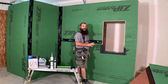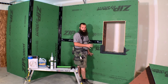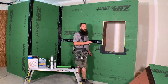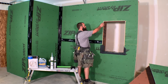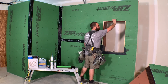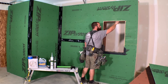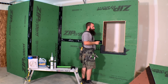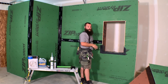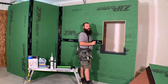Hopefully this has given you guys a good quick rundown of some tips and tricks I've come up with over the years of working with this product. It's a super robust method for detailing penetrations, waterproofing, and handling your flashings. Alternatively, once this is cured up, you can come back with some regular three-inch or three-and-three-quarter-inch tape and detail out this joint and the inside corner — so you're not just getting a watertight surface but an airtight surface as well. Then you're ready to install your window and have a really robust, long-term lifespan out of this window assembly.